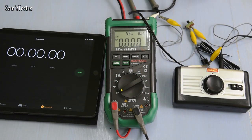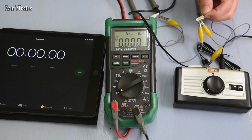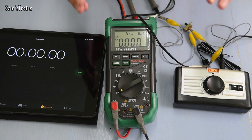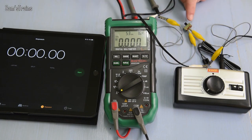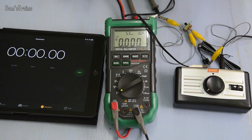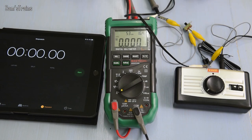The experiment will go like this: each controller will be set up one at a time. Connected to it is a switch — no other load — so when the switch is flicked, the controller will be short-circuited. It's also coupled to an ammeter, so the number of amps will be displayed on screen. When I flick the switch, having turned the controller to full power, I'll start the timer and we'll observe. If there is short-circuit protection, we should see the current drop immediately or not rise at all.